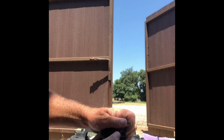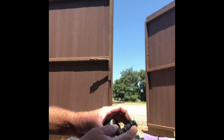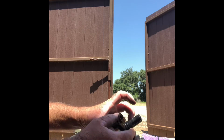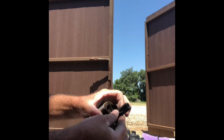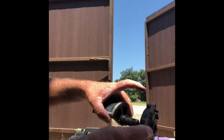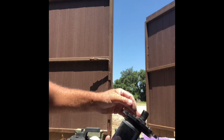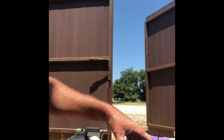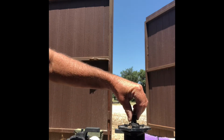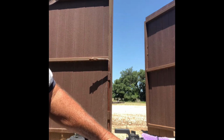You'll put O-ring, spacer, O-ring. Slide it all down. Now you can put some magic lube on here if you'd like. This one is still pretty lubed up inside of the head, so we're not going to do that. Put the lid back on it, press it down firmly, and then set it back into the slot. Now you'll remember this one was turned this way, so we'll set it back that direction. We'll put it back together.